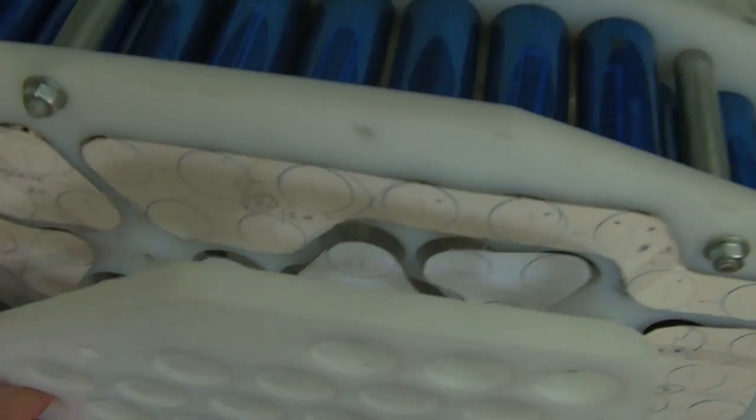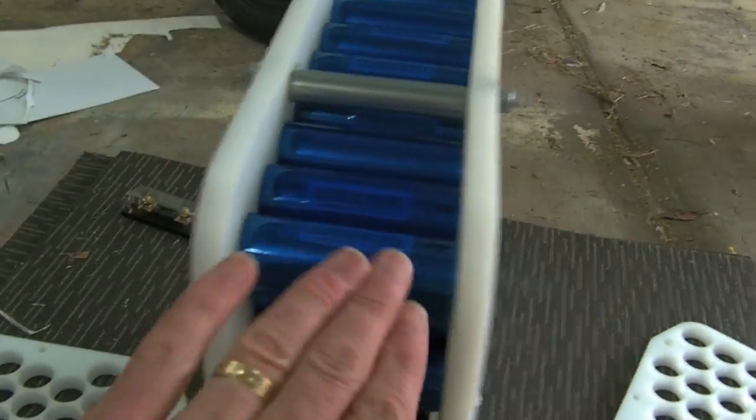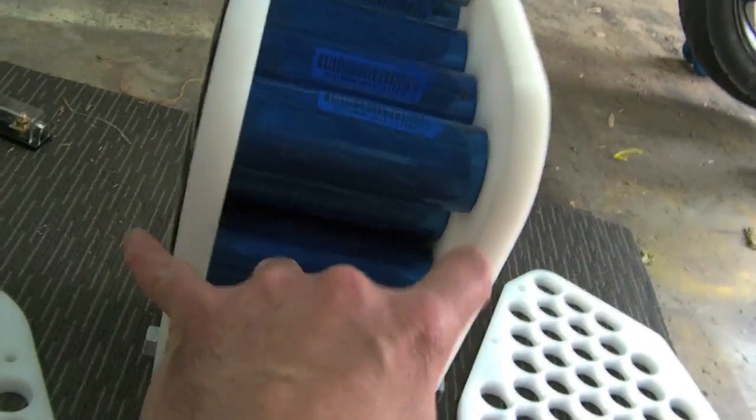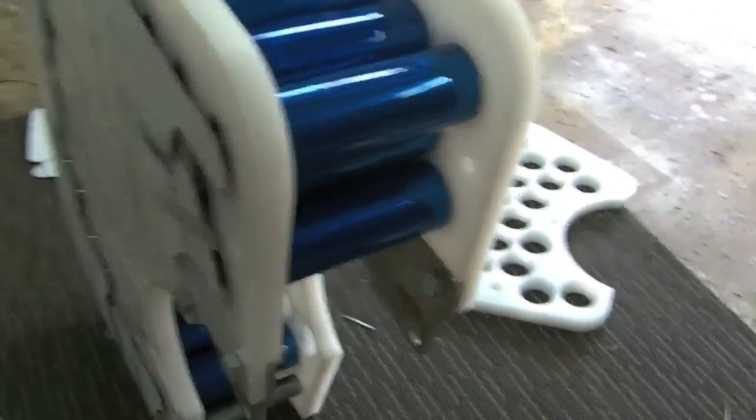You can see the double-width cells will go through that middle area. What that's allowed me to do is have battery positive here and battery negative here, so quite close to each other — quite easy for connecting and keeping the wires even.